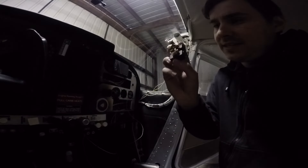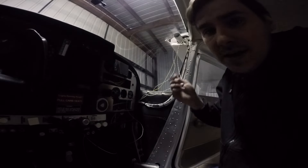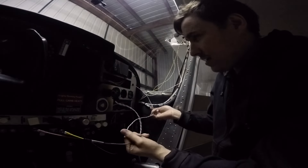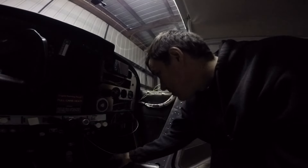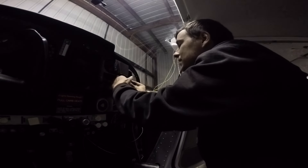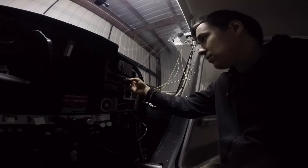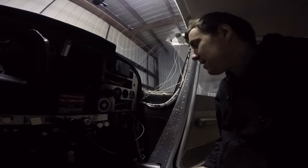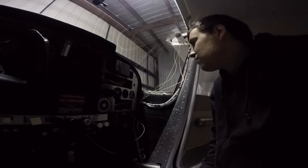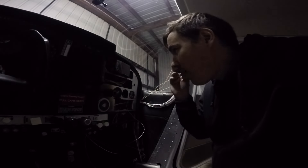In here for a minute — here is that 100 amp shunt that goes in, and here is the outside air temperature probe. I'm going to try to put the outside air temperature probe inside there; I think that'll look the cleanest. These are the wires for the ammeter right here — I sort of ran them up here out of the way. These wires tie into the GPS but they look the same. I think what I'm going to do with the shunt is try to install it in its existing location right back here, because this is where the wires already are. I don't really want to modify the electrical system if I can avoid it — I'd like to keep it how it was. I'll have to find a way to mount this on there, but once I've got that, I think I can do a pretty clean installation.